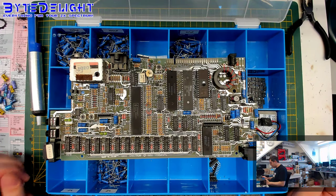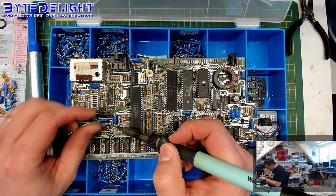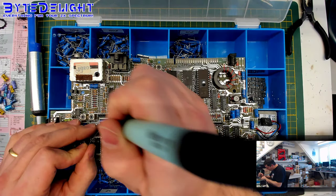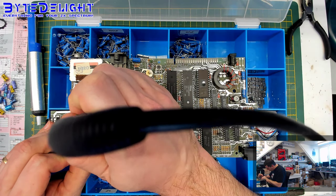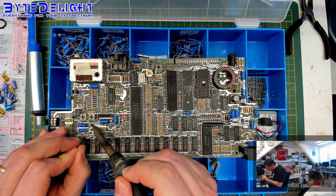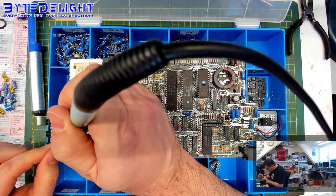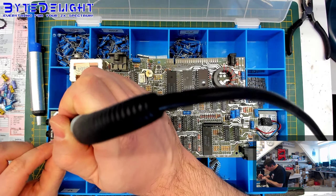We can now solder the capacitors to the board, and we'll cut the pins after that. And I usually solder the top and the bottom of the pads here, because it looks nicer, looks better, and also it can make a better contact, but I don't think that's so important. I mainly do it for looks, so you don't have any pads that look bad or something.